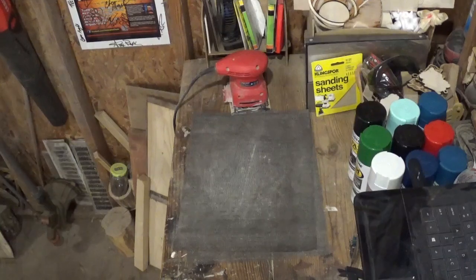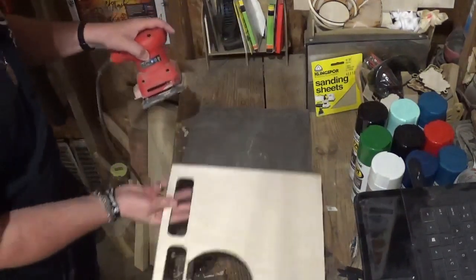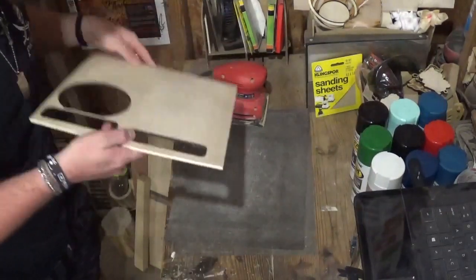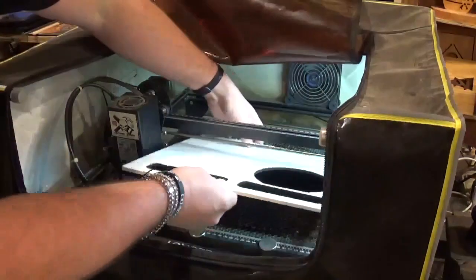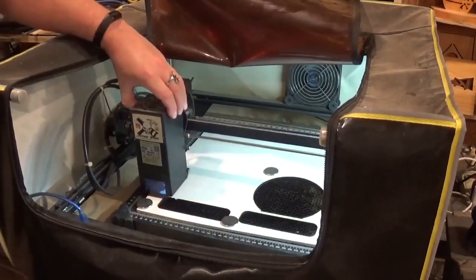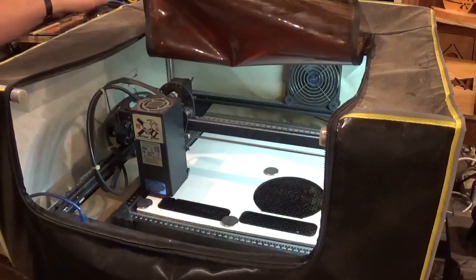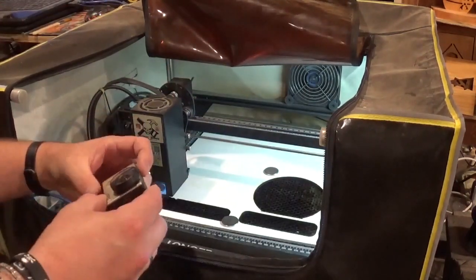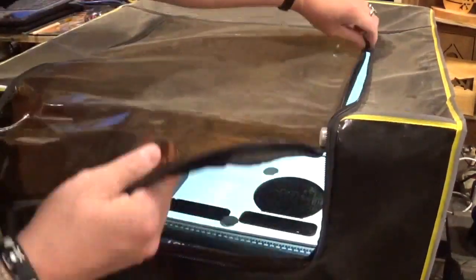And to do that, I will sand the 1/4" material both front and back with 180 grit Klingspor Woodworking Shop sandpaper, and I will take it over to the longer Ray5 20-watt diode laser, and I will use magnets to make sure the material doesn't move during the process, and I will frame out the design a couple times to take full advantage of the material here. And I'll turn on the GoPro and zip up the enclosure and hit start.